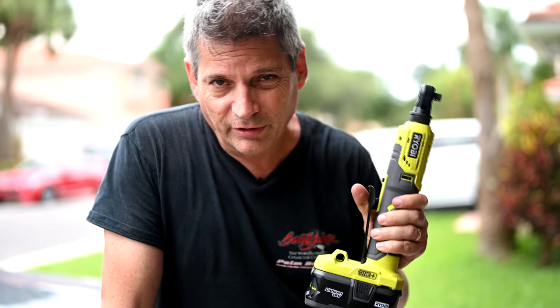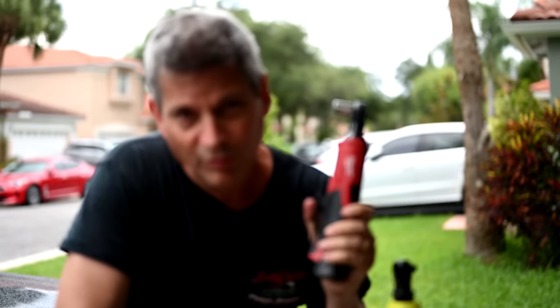You can see this only got single digits in torque. In fact, it didn't look like it came anywhere near 35 foot-pounds. Is there something wrong with our measurements? The Milwaukee electric ratchet also didn't seem to get much torque at all. So the fact that they're rated up to 35 foot-pounds — does that mean it can torque a bolt to 35 foot-pounds? Well, in this case, clearly not.